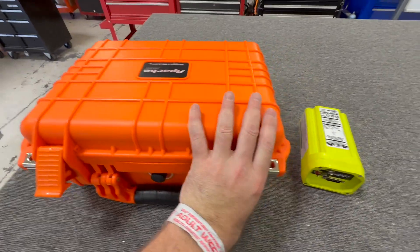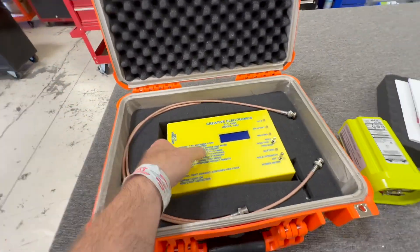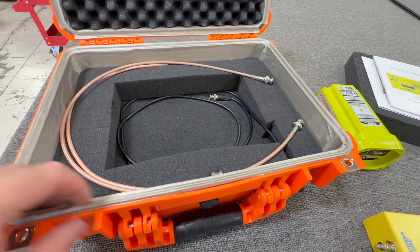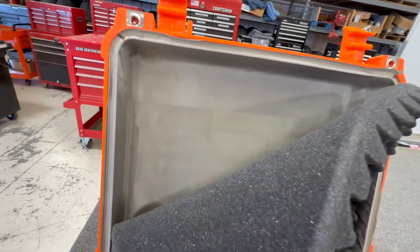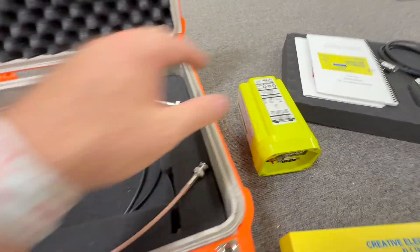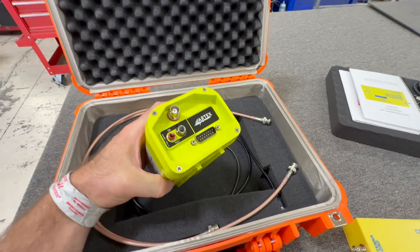This is a tester I put together. It's got everything I need to test for 406 ELTs. Probably the most important part of this test setup is not only the tester itself, but this case right here. As you can see, it's got a lining in it. Basically, this is a Faraday cage — copper and nickel material lined all the way through and on the edges, so it's conductive and completely shielded from outside signals. That allows me to activate the ELT, put it inside, close the cover, and not radiate signal out to the COSPAS-SARSAT satellites and trigger an emergency beacon rescue situation.